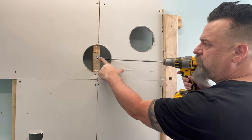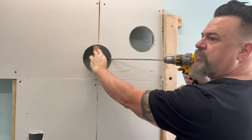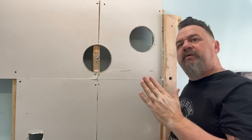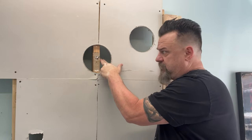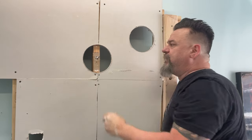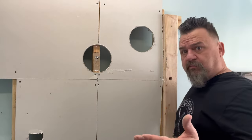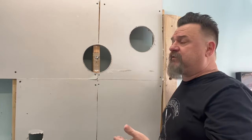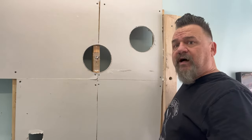You're going to get to the edge of the wood because it's at an angle, so you're going to drill right at the angle. You run the risk of someone running a screw in when hanging a picture. That's why you have to be an inch and a quarter from the edge of your stud back to the outside of your hole. If I were to use a smaller hole saw, I'd never get my hand in there. It simply wouldn't work. It's next to impossible.